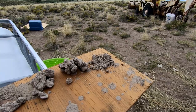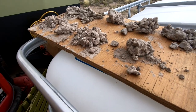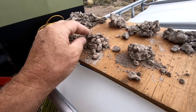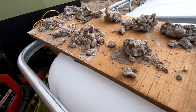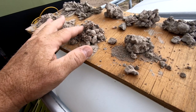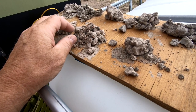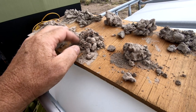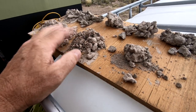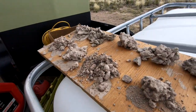They assure us we'll be pleased with the results. When you're drilling a well, what you're looking for are deposits like this that indicate gravel, because the same phenomenon occurs underground as on top. If you notice a riverbed, you'll see it deposits larger pieces of gravel along the shore. Underground it's similar — it means water is passing through, washing away the finer clay and providing a nice permeable gravel through which water travels. Should be a good well — we find out tomorrow.